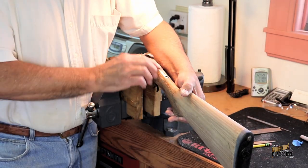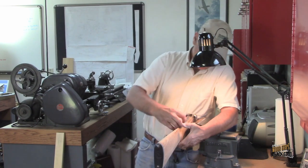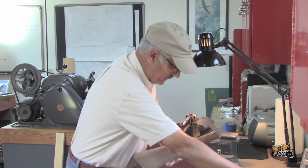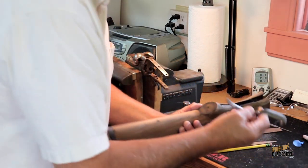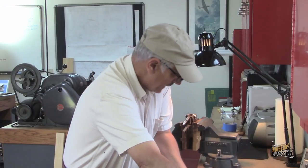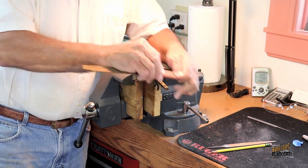With it mounted up, I'm looking for any differences in height. We've pretty much got this at this point — not unhappy with that. When we do the final polishing we're going to take a little bit more down. I've already done the trigger guard, and those two pieces of metal here and here are the match sanding for the metal and the wood. Last thing I want to do is just take a little bit of 100-grit paper and pull out the scratch marks from the file.